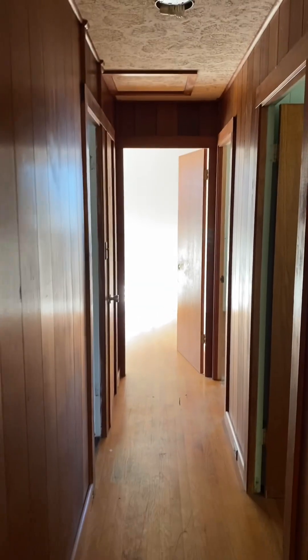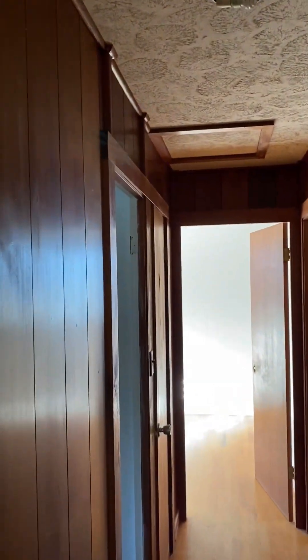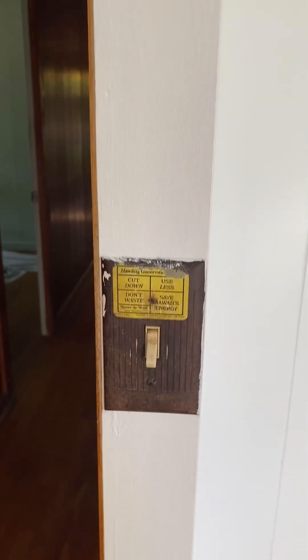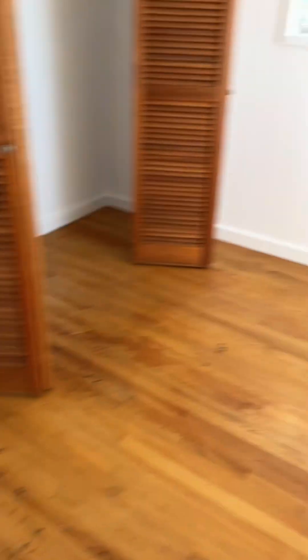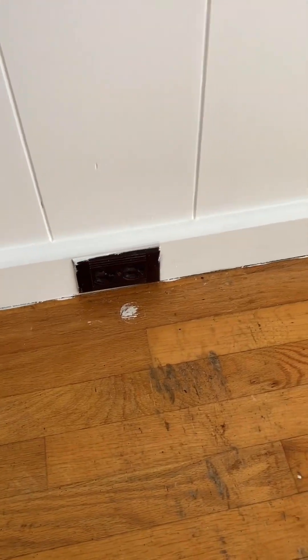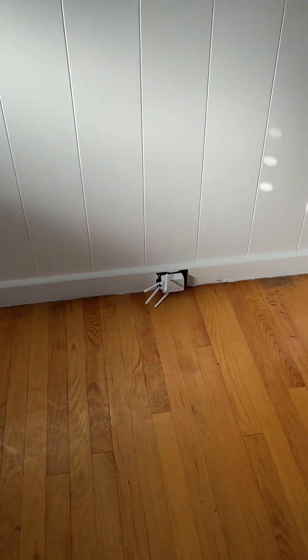So if you don't have a space between drywall and the outer wall, where do you put your wiring? Here is a clue. You usually will have wire mold like this, and it's often hidden inside the trim. Here's another example — you can see that the light switch is on the trim, so the wiring is going behind there. All of the outlets are on the lower trim down here, so you can tell that the wiring is following behind all of that trim.